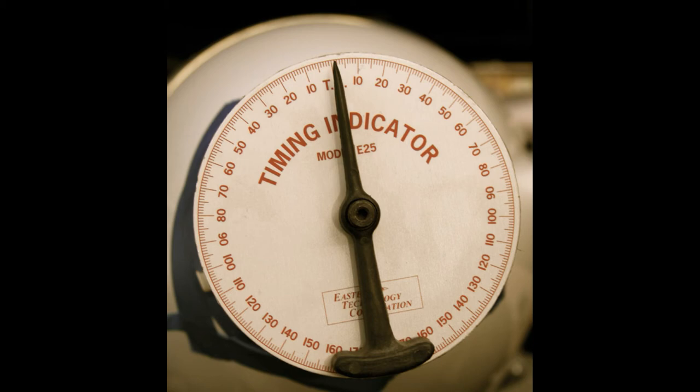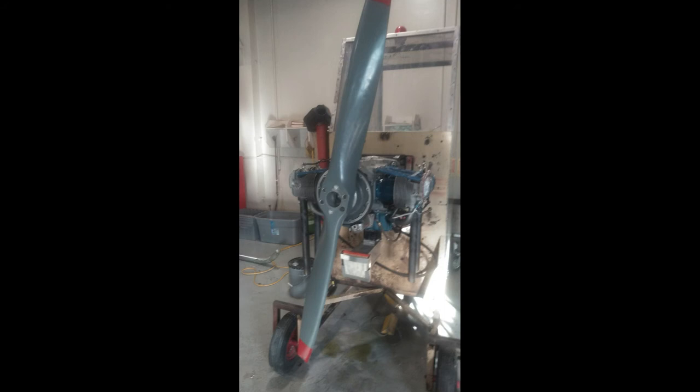After that, we got our prop flange on, we got it hooked up to the run stand, and we ran it. It took us a little bit because the starter was not grounded completely. Someone had forgot a nut or thrown away a nut that needed to be on there, and so the primary lead had to be between two nuts, and we only had one nut. We didn't know. It kept arcing. It took us about 3 hours to actually find it out.